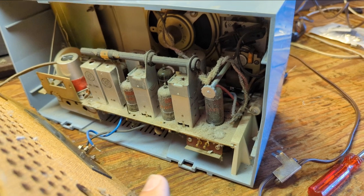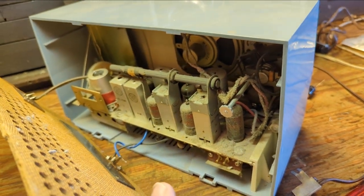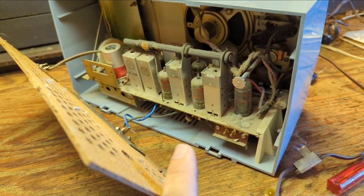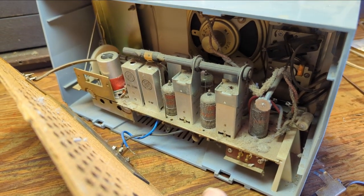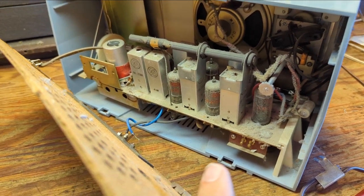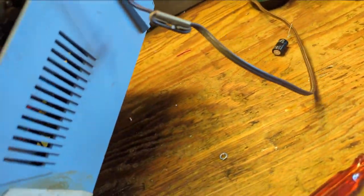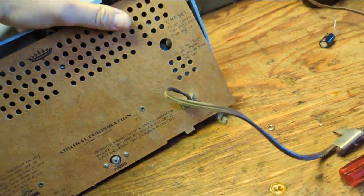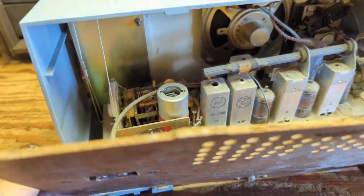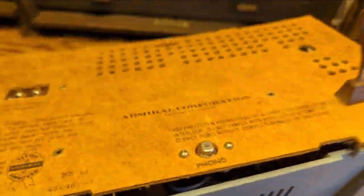The electrolytic is probably fine. I find that a lot of the Japanese electrolytics from this time period just really hold up. I may or may not replace it — I'll take a look and maybe do a leakage test. It looks like we are firing on the original tubes; they've all got the same reddish Admiral print on the sides. As far as getting this out of the case, it might be a hot chassis — there's no screws I can see attaching it through the bottom, so it probably goes all the way to the front.